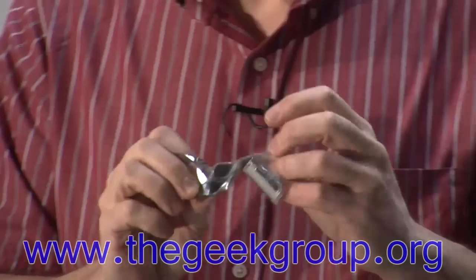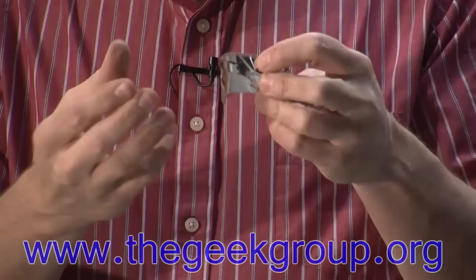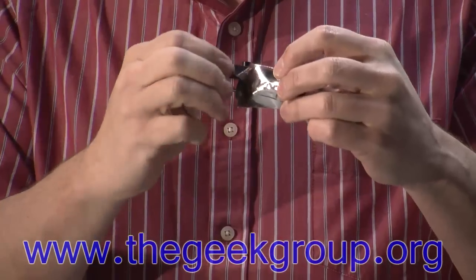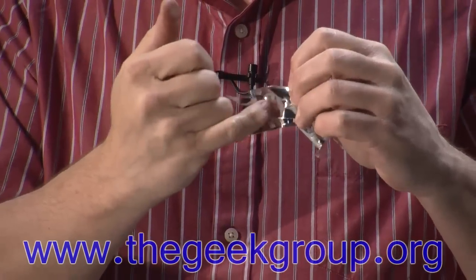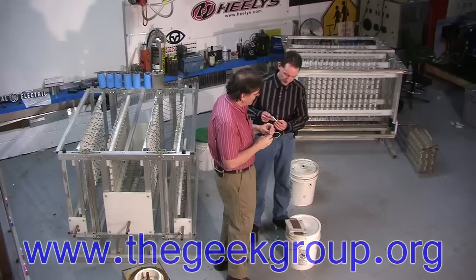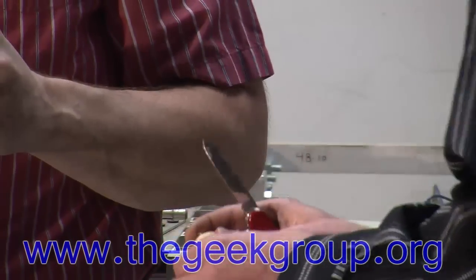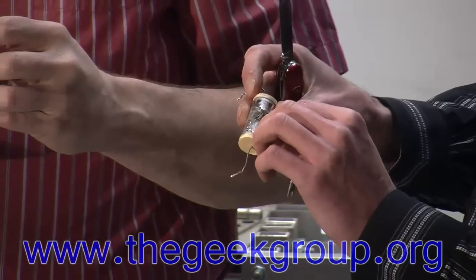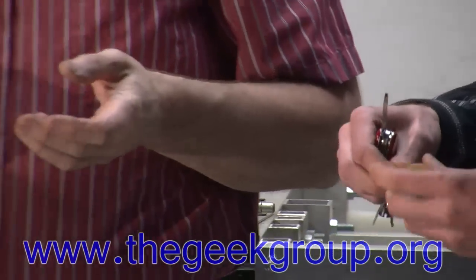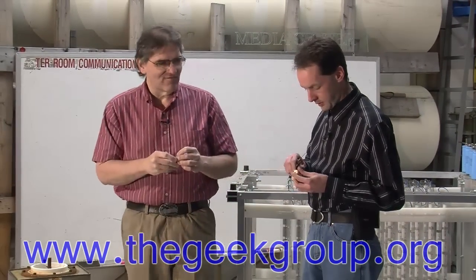Now, what allowed this cap to have a hole blown in its side and still be functional is that when you get an arc over, when the dielectric fails and you get a spark jumping from one plate to the other, the foil burns away more than the plastic. So you get a little hole in the plastic and a big hole in the foil. Right here, there's the big arc. There's a big arc here, and the hole extends beyond the foil. So in effect, the capacitor heals itself. It fails in such a way that it's still all right after the failure.